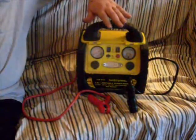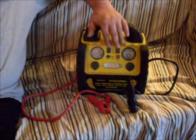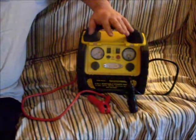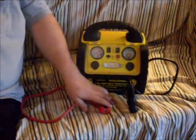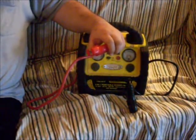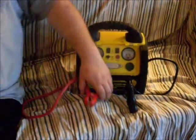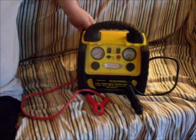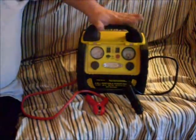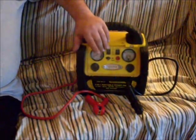This comes with a charger to charge it off of twelve volts and off of household voltage. Neither one of those seems to pull it up to an appropriate amount of charge, or it takes a very, very long time. What I do is take my car battery charger, hook it up to these probes, put it on two amps, and let it charge until the charger says it's fully charged — just hook it up to these jumper cables, make sure the switch in the back is turned on. Charging it that way for five or six hours will have a really good hot charge on this battery that stays for a long time. So the chargers that come with it aren't great — it's a good idea probably to get a battery charger.